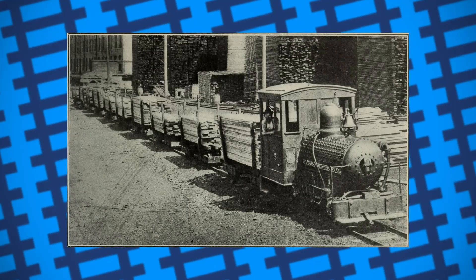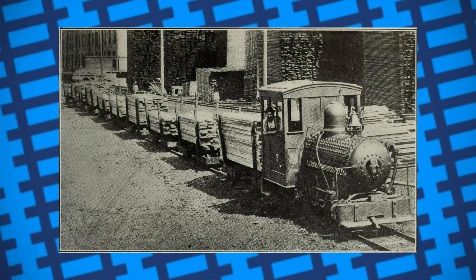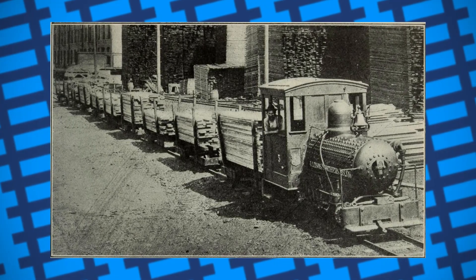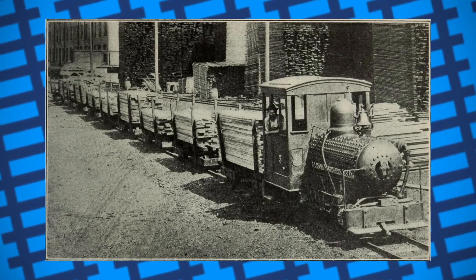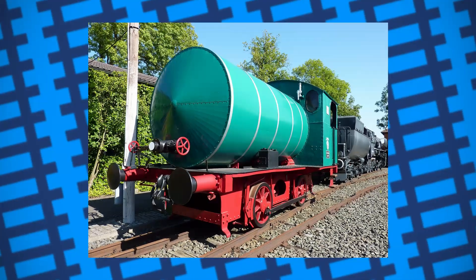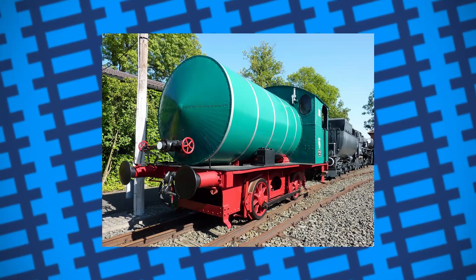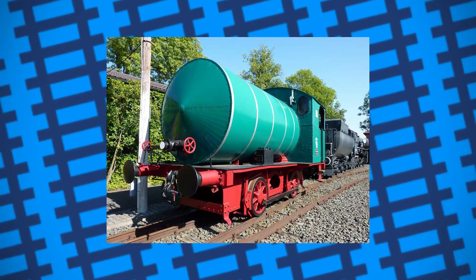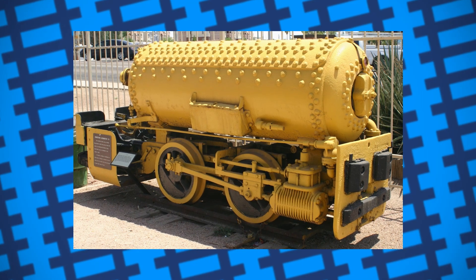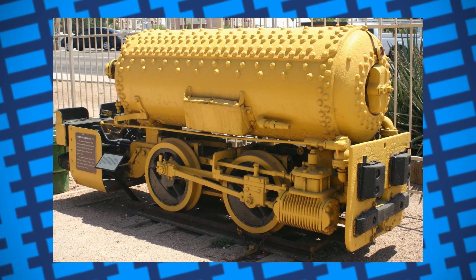Most power plants and other facilities that produce large amounts of steam can just pump some of it to an outlet so the locomotive can be filled up. The fact they don't have a fire or produce smoke and exhaust fumes makes them ideal for moving around sensitive or flammable materials. And 90% of the time, most shunting engines stand idling instead of moving, wasting fuel. As fireless engines don't use any of their stored steam unless they move, they can be left standing for long periods of time without wasting any of their own power. Some of them don't even require steam, instead running on compressed air if steam isn't an option. As well as shunting, they're also used in tunnels and mines, where electric or diesel alternatives aren't viable.